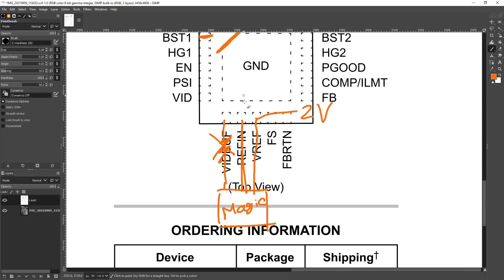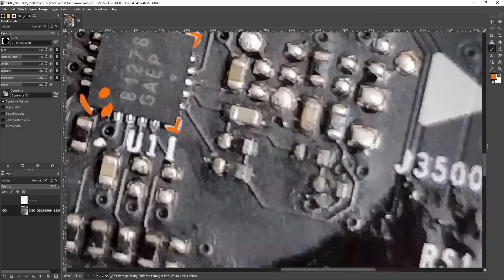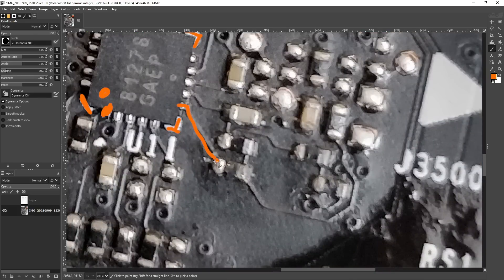On a lot of cards you might have an idle power state for the memory, so I generally like to disconnect the stock voltage controls, because there's nothing more annoying than trying to modify the voltage with your volt mod and having the software counteract your modification. This is a very real issue with vCore on NVIDIA GPUs - if you start offsetting the core voltage upwards, the driver starts compensating by pulling it downwards. So as a policy, I just remove VID buff connections - remove this resistor, and bye-bye VID buff.